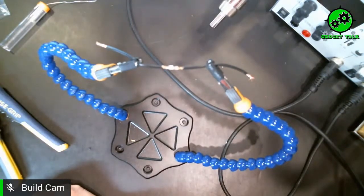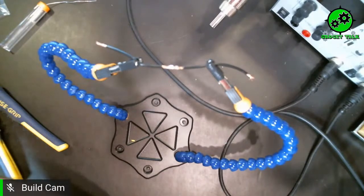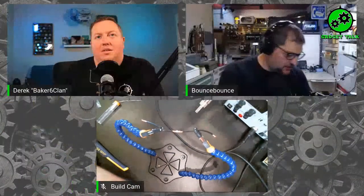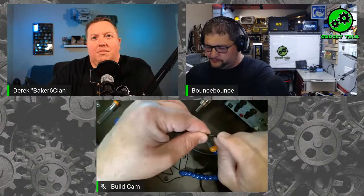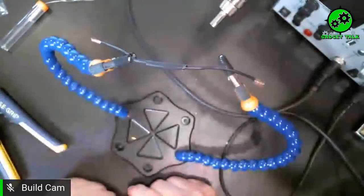If it was soldered, then you'd have a good mechanical connection because it's all twisted together. Right. Some people will actually twist them in several different directions and back again, which gives you a great mechanical connection. And then you would want to either use black tape if you really want to, or use one of these shrink tubes here.